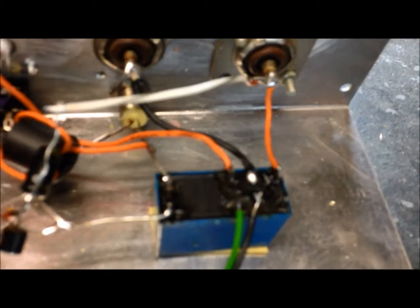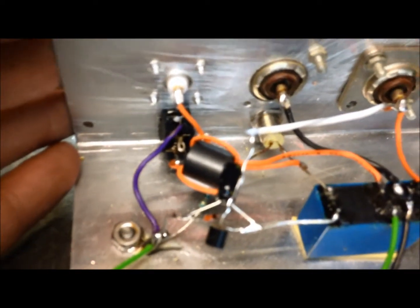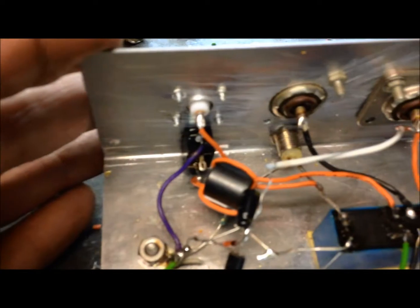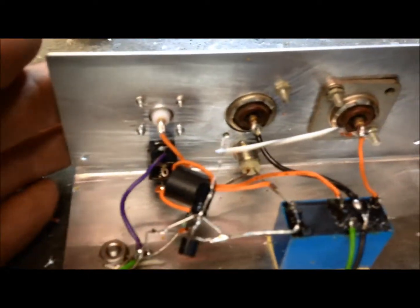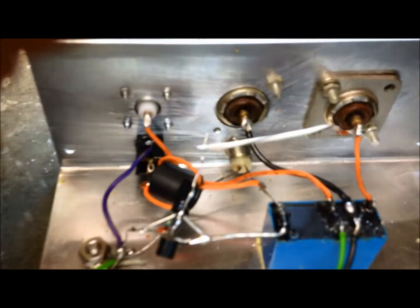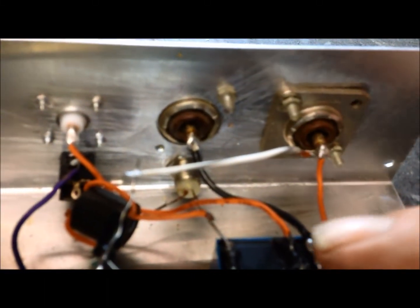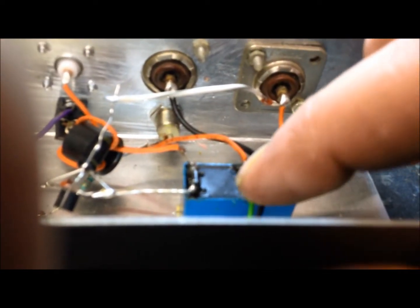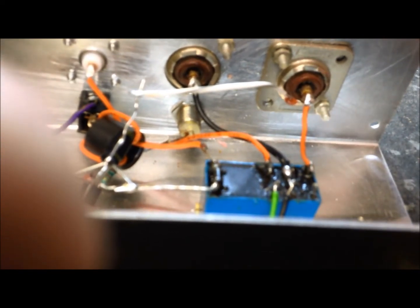Basically all I did is I took a 5 amp relay - I didn't think I needed much more than 5 amp with just a radio going into it - and wired in a small style key-in circuit, kind of like what they put in amps but a little different. We don't want it to hold open too long, so it's basically milliseconds that it closes up. Radio's here going in on one side, antenna's in the center, and the SDR radio will be on this side. Over here you get your 12 volt power and key circuit, the other side of the relay I use for muting, and I still have an open pin I could ground or use for something else.